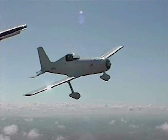Mike asked me when I was up there, could we make it go even faster? What would we do? So I did a few studies. For an airplane of this size and weight, and for the stalling speed that he has on his airplane, I looked at all the airfoils that I had data on in the right Reynolds number range to get the same stalling speed. I did it for two cases: one with no flaps, and one with full span flaps, because he was partway in between with partial span flaps. Of all the airfoils, the two he chose turned out to be optimum. They gave the lowest drag area, that is the drag coefficients that we got for him times the area of the wing, to get the same stalling speed.